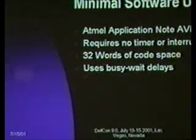He asks, the clock is somewhat unstable. What do you use, a crystal to clock it? And again, the audience is getting ahead of me. If you wait just about 2 more slides, I will in fact address that. But yes, there are definitely clocking problems on an asynchronous interface, in that you have clock drift. And there's a couple of ways around that.